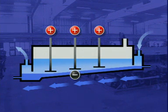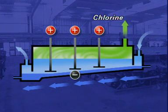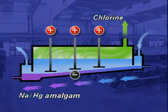During electrolysis, chlorine is discharged at the anode. Sodium is discharged at the cathode and dissolves in the mercury, forming an alloy called an amalgam. When working, the mercury cathode cell is sealed. This cell is being cleaned — it's not working. This is the flowing mercury cathode that runs the length of the cell.